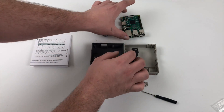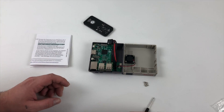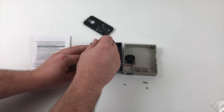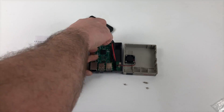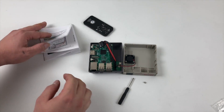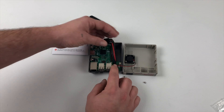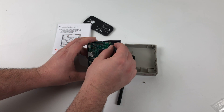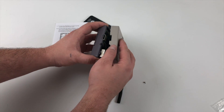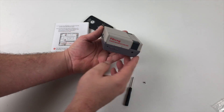Now we just need to drop the Raspberry Pi in here and screw it to it — four screws. It does come with five, so you get one extra. That's always a plus; I'm always misplacing them. It comes with a small screwdriver. It's non-magnetic, so you might want to magnetize it before you start. We'll just put all four screws in. After you have all the screws in and the Pi is secure, we now need to plug in the connector. The manual shows you exactly how to plug it in and make sure it is also plugged in correctly to the board itself — just make sure the red is up top. Now all we got to do is snap the case together. There are snap blocks on here. They fit perfectly and the thing snaps together very tightly, so it's all flush around each edge.